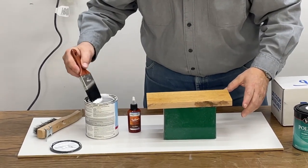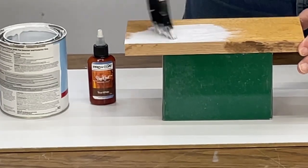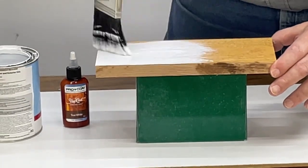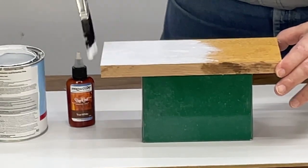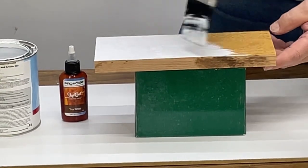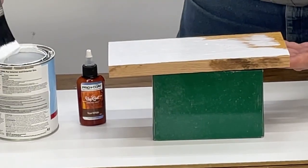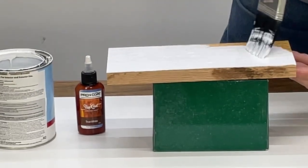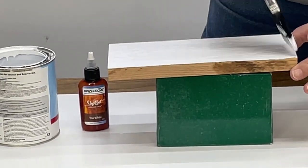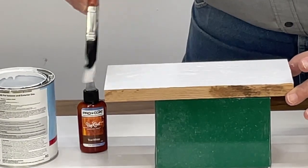I've already stirred my paint. This primer that we're using I've used several times now and I've really fallen in love with it as a primer coat — it just really does well. It usually takes two coats, and it did on this piece. It took two coats to cover that golden oak real well. Then you've got to go back and seal it, because this is not a primer sealer, it's just a primer — but it's a really good primer. You want to make sure after you've gone through and used your wire brush that your primer coat isn't too thick, filling in that grain.